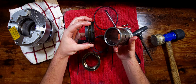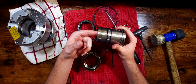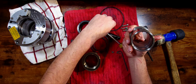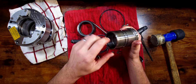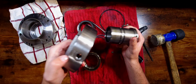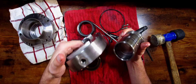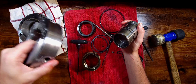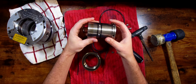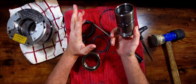These machined surfaces are probably the most sensitive, in my opinion, to have a leaking issue. These O-rings tend to do pretty good overall, but this inner O-ring gets really worn, and this outer O-ring can get really worn. This one doesn't stay lubed with oil like most of these others do — these others will have a little bit of an oil drain or trickle hit them. You can actually see you have what they call the flush point or port here, and then the drain is down here, so it's putting oil in through it and then draining out. It has a little bit of oil seepage, which is completely normal for these — that's the little canister on the bottom of the D-housing. Per the factory, you're allowed to fill it about once every 14 days and you're doing okay.